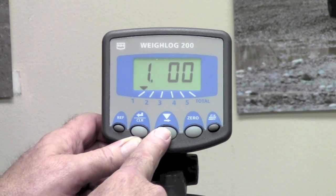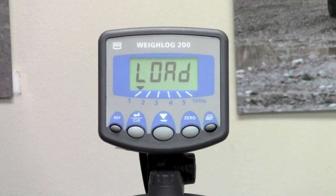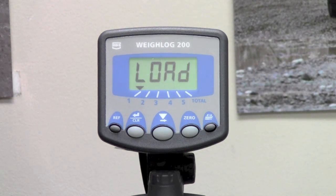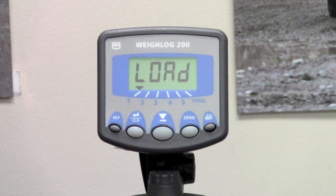We are going to be satisfied with leaving 1.00 in there for calibration. We press the clear enter button and the unit immediately tells us to load fast. Load fast means we are going to run the RPM of the loader up at a high RPM, put a full bucket load into the bucket, and then raise the bucket at a high RPM. We should always bring the lever full back into the lock detent position and lift all the way to the top.